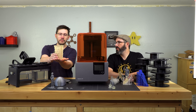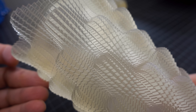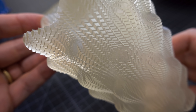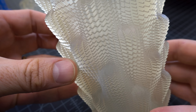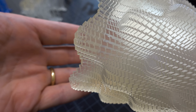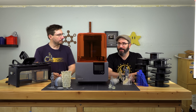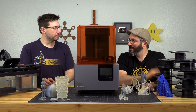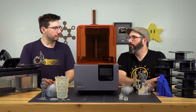This base right here — I was able to print it slightly larger using FDM, but the resin-based 3D printer does such a fantastic job. The Form was able to complete over 9,000 cubes in this model and everything is smooth on the angles. You can't see the layer lines. That's no hyperbole. When you get a really good FDM print and look at it next to a resin print under a magnifying glass, it's not even in the same world.